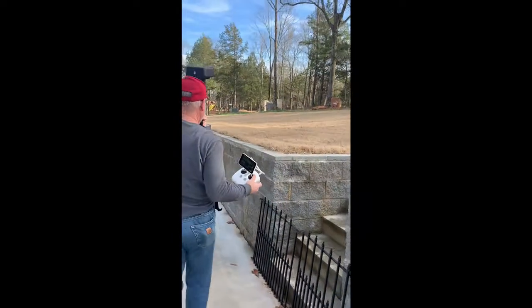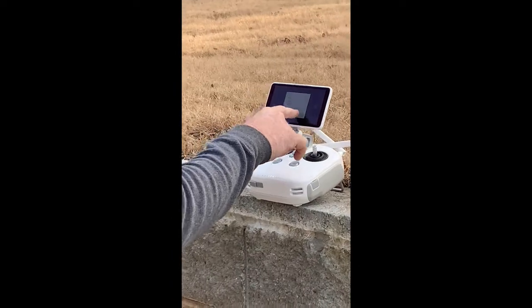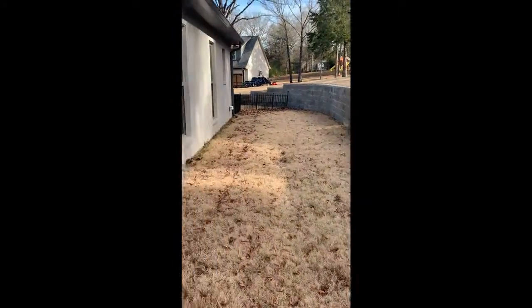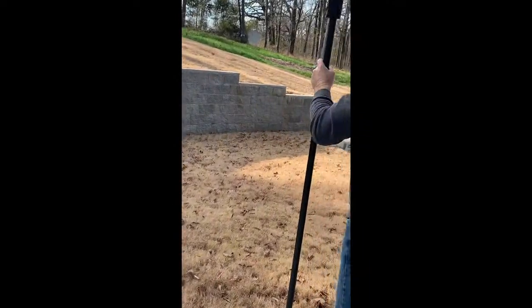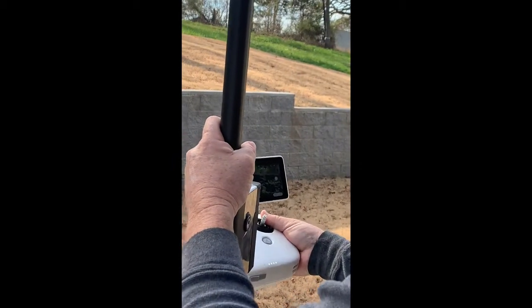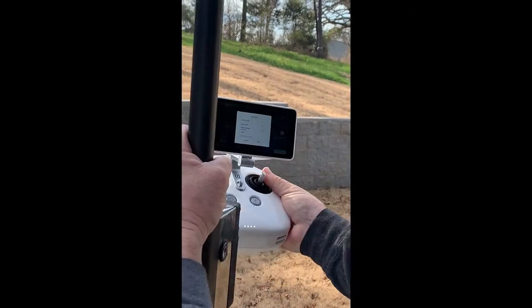I'm going to move down a little bit. Click C2 again — point number two is marked. Save that. Mark a third point and save it. For the fourth point, I had to wait because it went into float mode. Now it's fixed again — it wouldn't let me mark the point in float mode. We're fixed now, that's point four, and we're ready to save it.